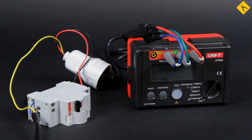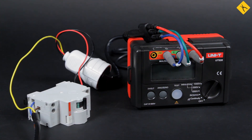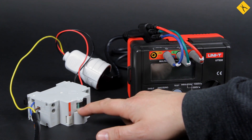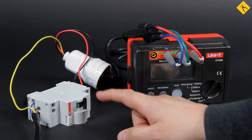Here I need to say that you may conduct a primary RCD test very simply. All the breakers have a test button — you just press the button and the breaker switches off, so the protection must be working. But keep in mind that this method tests the RCD module only, and we cannot test the devices for correct installation. For example, we won't know whether all the sockets in this room are connected to the circuit breaker correctly.